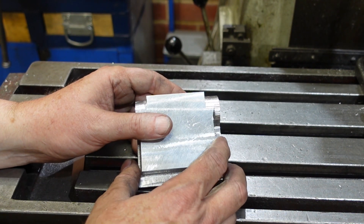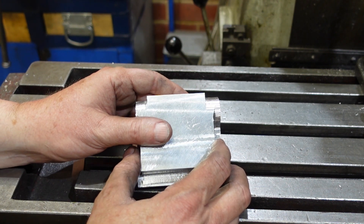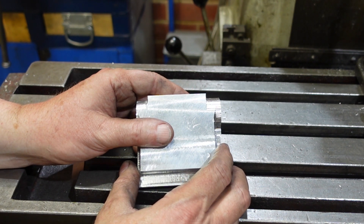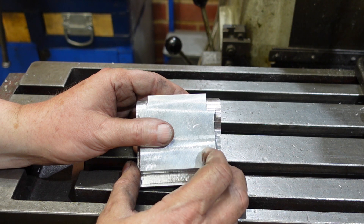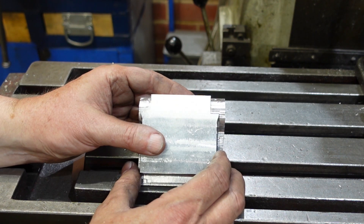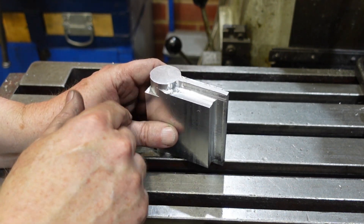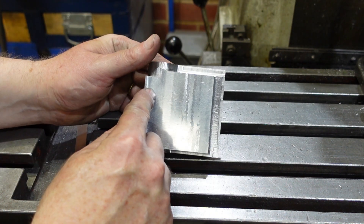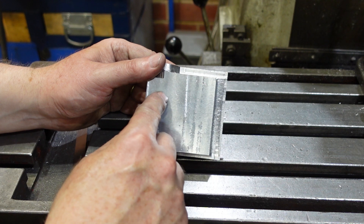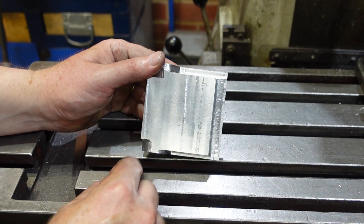I think there's something wrong with the Volstro head — it might be due for some new bearings because it wasn't happy towards the end there, and that could explain why it was throwing nuts off with all the vibration. Anyway, that'll clean up and once I've got the outside shape roughly where I want it, I'll come along and cut that piece out and that'll give me a clevis.